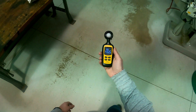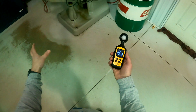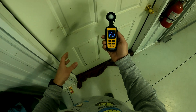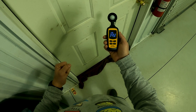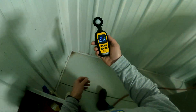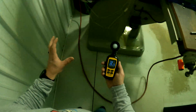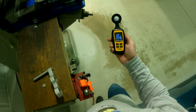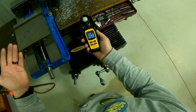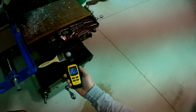Under the other light we're going to replace, it's about 420. As you move away from those lights it gets less, obviously. In the middle of the shop we're in the mid-300s. Going over to the corner behind the Bridgeport, it drops down to about 170 to 180 lux. We'll use those numbers as comparison to the LEDs we put in. Right here at the Bridgeport machine where I'd be working, it's right at 300 right now before we swap it out.